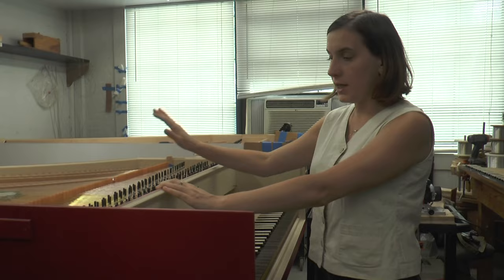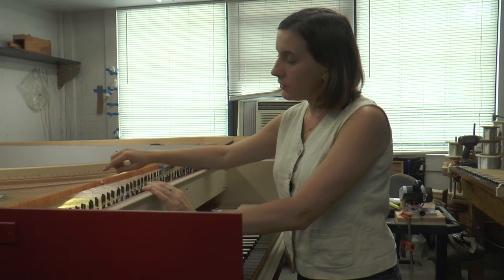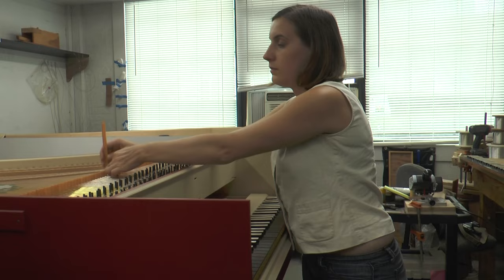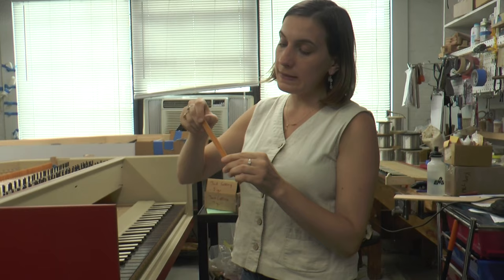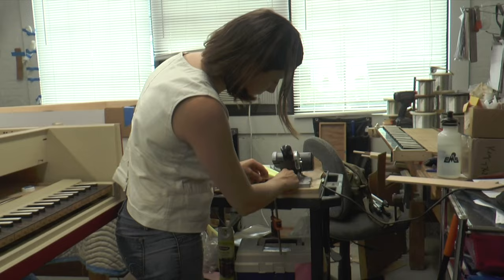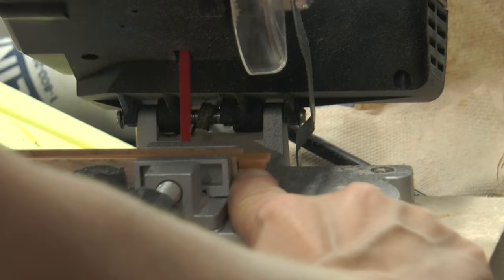Now our step five for jack cutting. We marked out a few jacks — we'll have to do it little by little. Now we're going to cut the next jack. The way we cut — which is pretty important — is that we do not cut off the line. We cut just after the line so the line stays on the jack. That's what it will look like. You can see my line on the right, right next to the edge of my cutting jig.